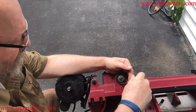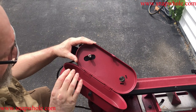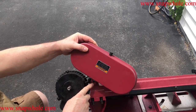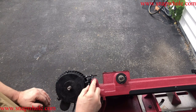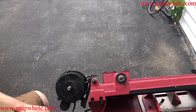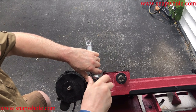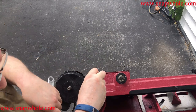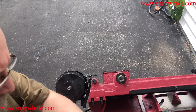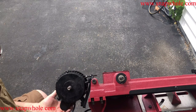This has a support that goes in under this screw. You don't want to try to take the screw out without holding the nut — if you don't, that whole hinge piece will come off. It's not a problem to take it off, I just don't really want to do that. Take the screw off only — it has a lock washer on it, you probably don't want to lose it. That's actually a good design feature.